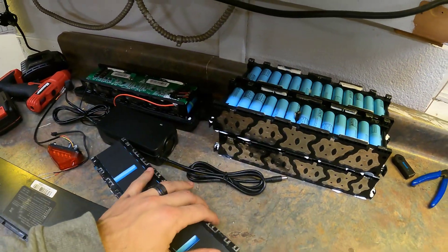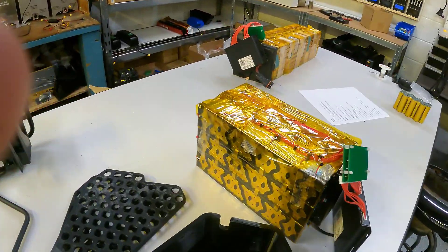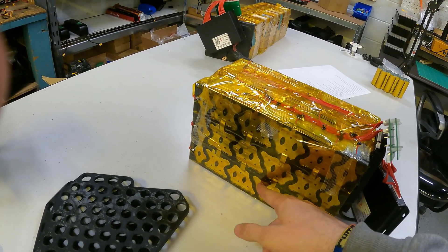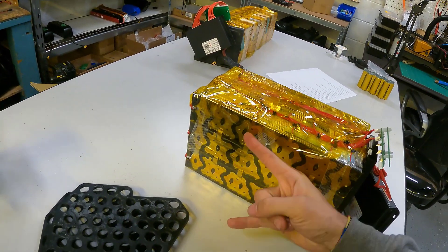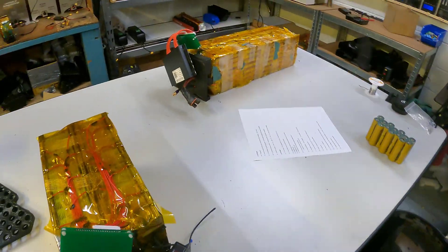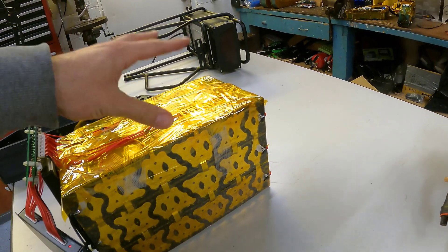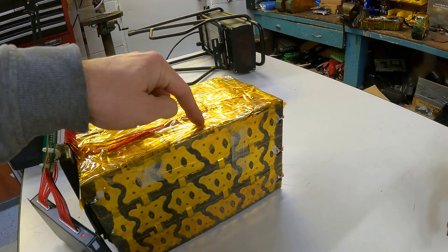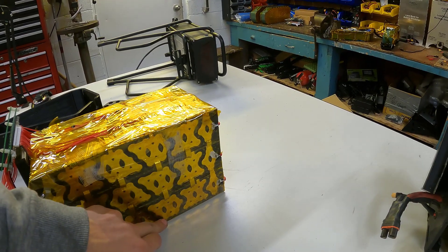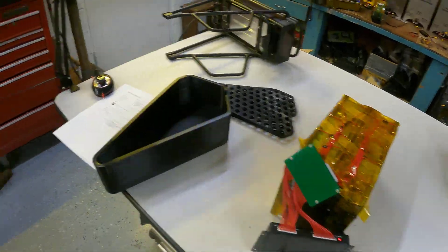Let's take a look at this — this here is a 72 volt battery. It has six of these packs together: three here in parallel and then two of them in series, connected by wires. So this is a 72 volt, 38 amp hour battery, which is pretty big. That's 1500 watts a pack, so 9000 watts peak that a battery like that could do.